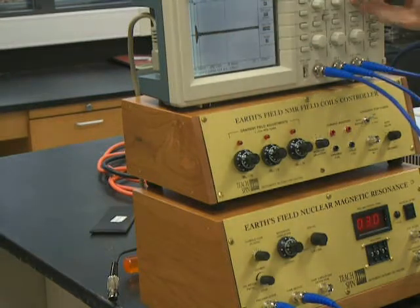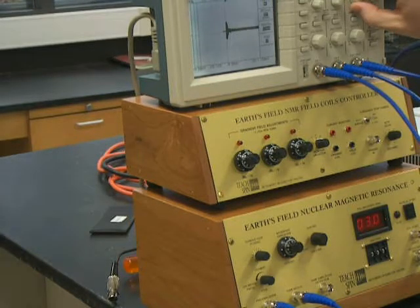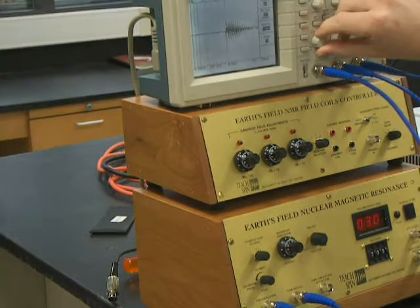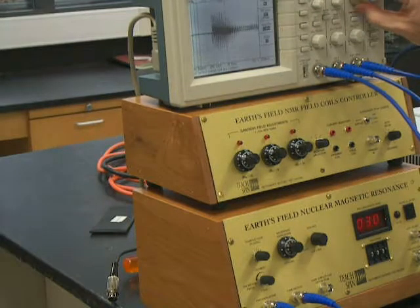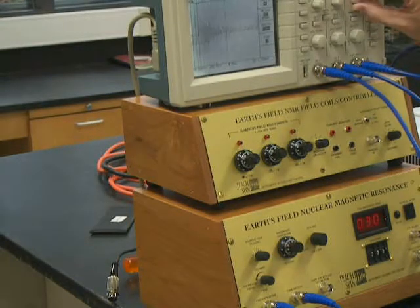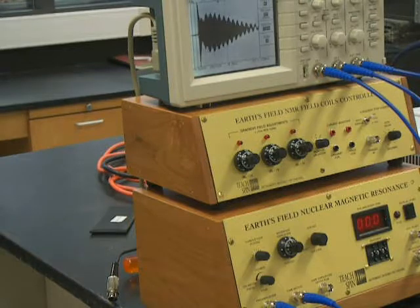Now we're only talking about 200 milliseconds, so let's position our spot right there close to the middle, and then zoom in. The signal's a little bit weak, so let's increase our voltage, then scroll back over just a little bit, zoom in one more time, and take one more set of data which will give us a better reading on our oscilloscope. It looks bumpy, but that's okay — some of that bumpiness is due to the AC running in the walls and in the lights.